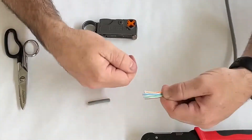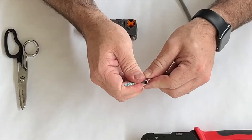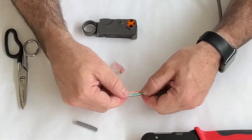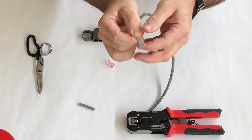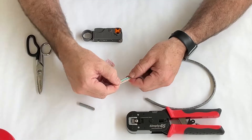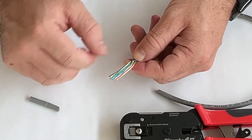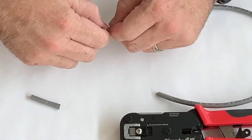I'm moving my hands back and forth, letting the conductors slide between my fingers, and using the jacket as a kind of cable comb to flatten them out. You'll notice they're staying in the right order — and if they aren't, that's when you look and move things around while they're still nice and long. You'll see the green pair is split with blue in between it.